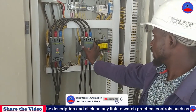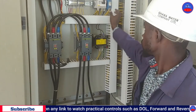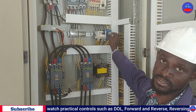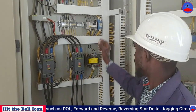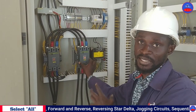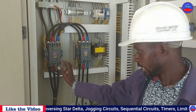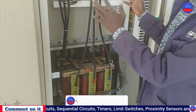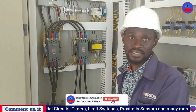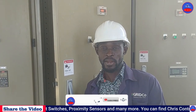When you start it, the starting contactor will energize first and the timer will also energize and begin counting. After the preset time, the timer will switch off the starting contactor and then start the running contactor, putting the full voltage onto the motor. That is basically the operation of a starting reactor.